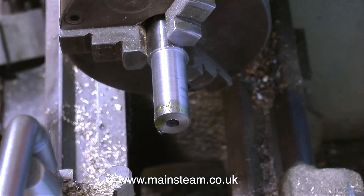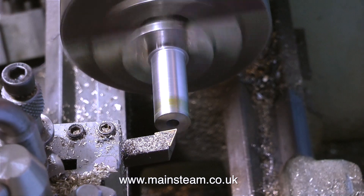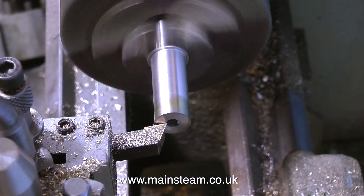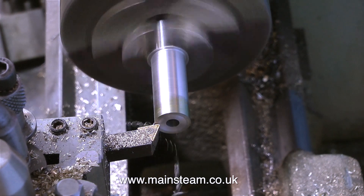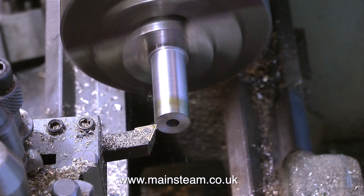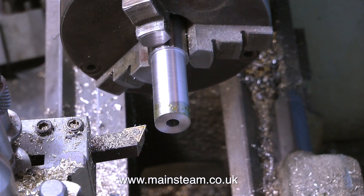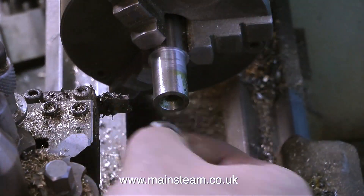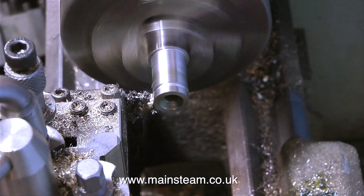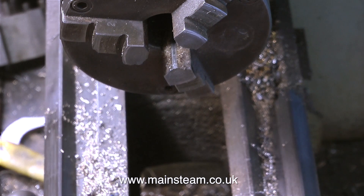By now you should have a good idea what I'm doing. First I clean off the front of the piece of metal with a carbide tip tool, which doesn't need grinding - I use these increasingly more these days. What I'm doing here is facing across the front, and I'm pulling the tool backwards, which just seems to give a better finish. So as you've just seen, I countersink the end and part off the piece, and eventually I part off all four.